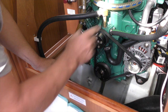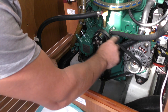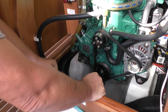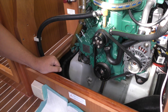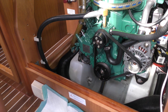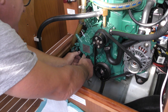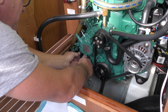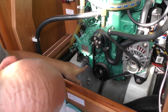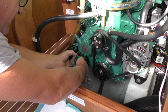Here's our engine bay. While we were here I've cleaned around with some rag, taking the alternator dust off, checked our serpentine belt — that's fine — generally giving the engine a bit of a clean over and I've cleaned the bilge out from that salt water. We have our pump here with a little drop of oil on the gear wheel and the first thing we're going to do is to locate a new o-ring in the opening.